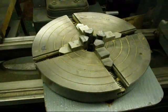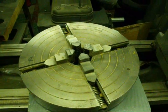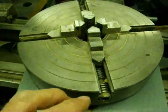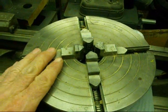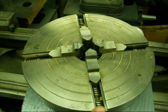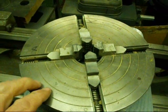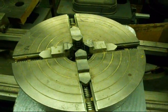The other type of chuck — I'm not really going to talk about it today — is a four-jaw chuck, called an independent jaw chuck because each jaw moves in independently by a screw, and you can see the screw. These chucks have a lot more pressure and can hold the work a lot tighter because you're using an acme screw — actually four of them — to tighten down. They can be more accurate, and that's shown in one of my other videos as well.